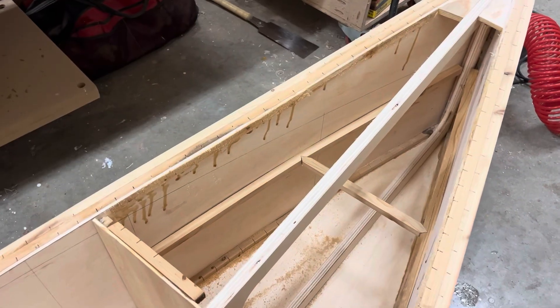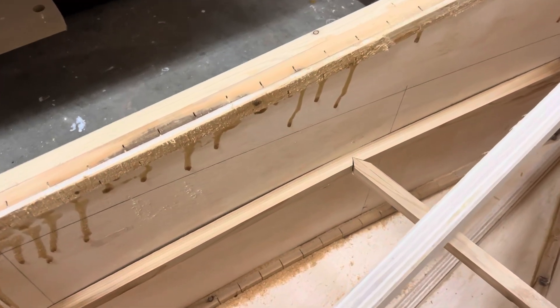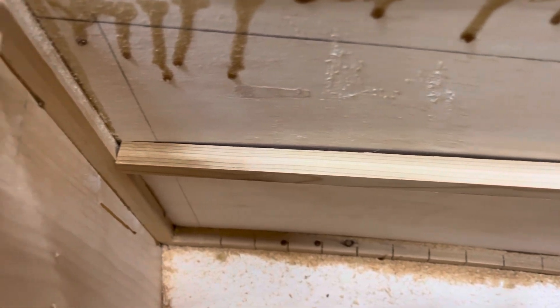Here is my solution for keeping the sidewalls on the bow from collapsing inward. I made a spar in the middle with joinery here and here so it's pushing outward, and I do have to kerf it a little bit on the inside — just a hair.